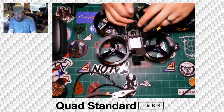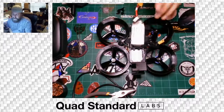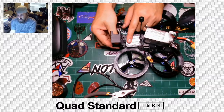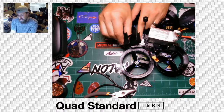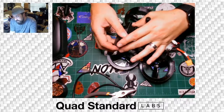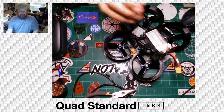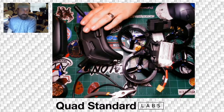There are two battery straps on here for your 5S 1550s. You can also run 1300 6S if you'd like — everything is power-regulated so you don't need to worry about adjusting anything. With the camera mount, be careful: it has a little overhang, so gently move it into the position you want without pulling or pushing too hard, then slide your camera in. So that's your new platform. If you have any other questions, let us know — talk to you soon, thanks.